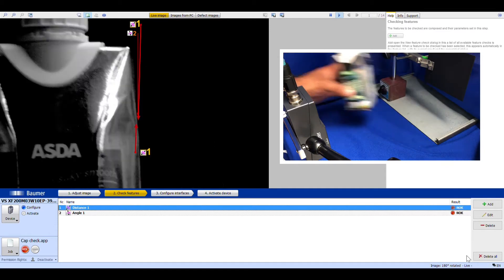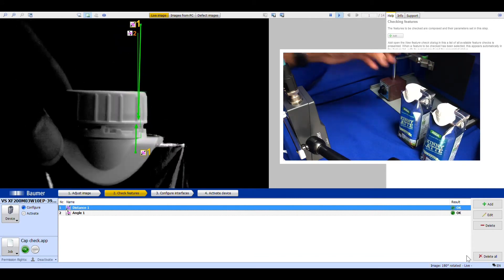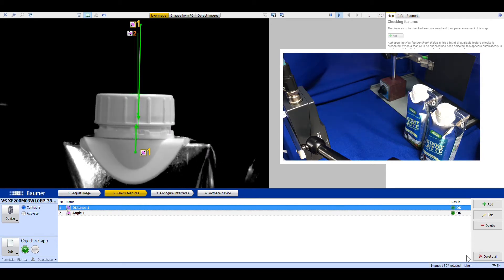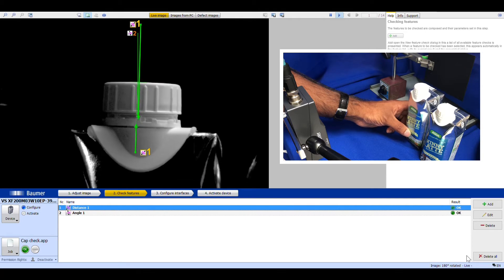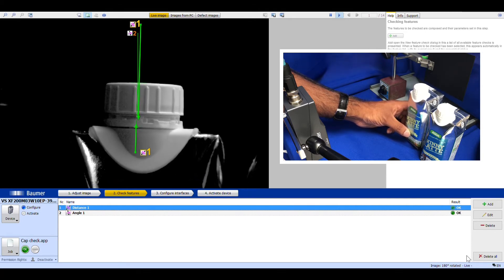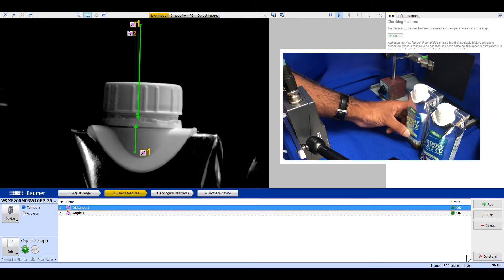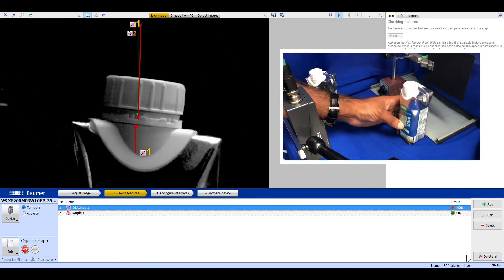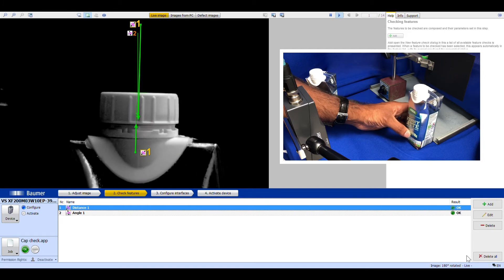Just to prove that you can do it with different packs — as I'm sure you'll be wondering what it's like with different bottles of the same kind. I've allowed for some compensation on moving up and down because we're measuring between the tamper seal and the top of the bottle, ironing out any natural variances. And you can still see both are passing OK.